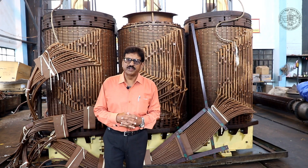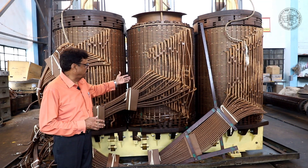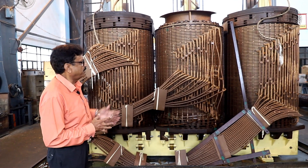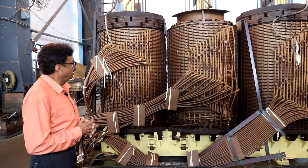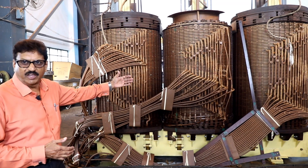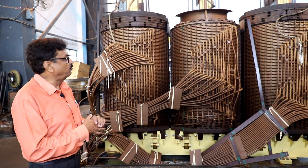Regular power transformer repair is done here. In this continuation, a 132KV Sultanpur transformer of 20-25MVA has been repaired for internal investigation. Now you are seeing the picture — this is your internal view. We call the un-tanked part the top assembly, which contains your core. The winding is wound on the core.